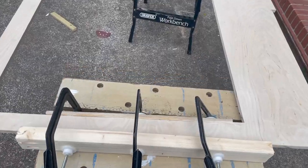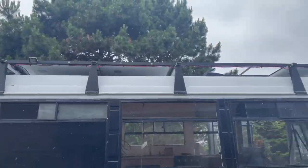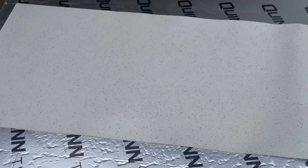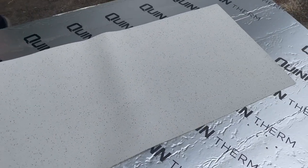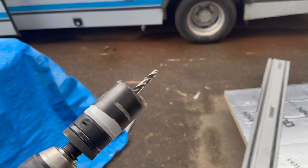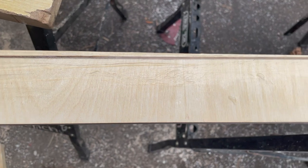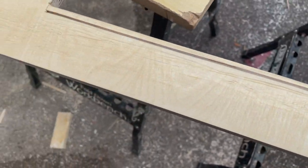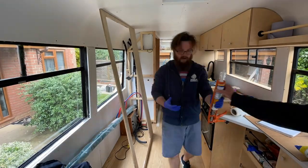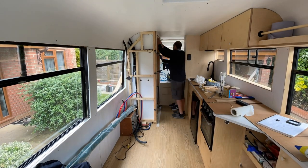What a terrible error. After a short while it was straight onto the repair — we packed out the gap, filled it with sawdust and glue, and then waited for the rain to pass. Whilst we were doing this we drilled out the shower tray and used the drill bit to make sure it was accurate before filling in the back of the plywood with some Sikaflex sealant. The front was then installed using Sikaflex, brad nails, and screws through from the back.